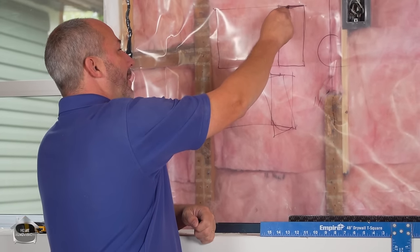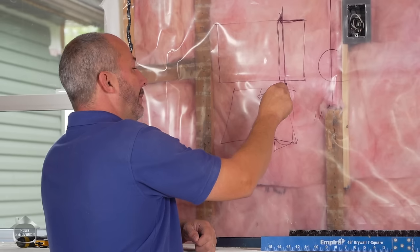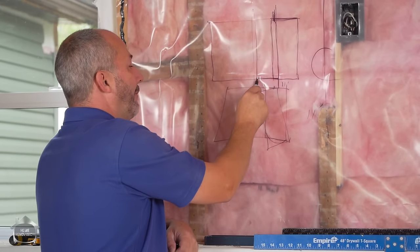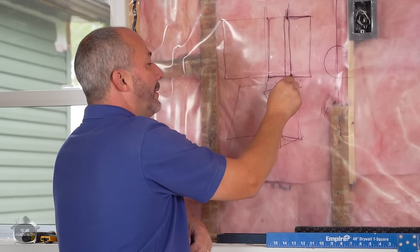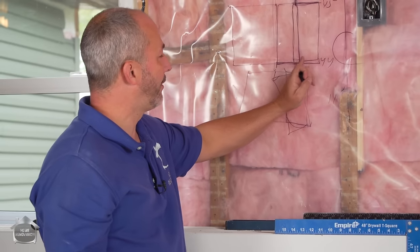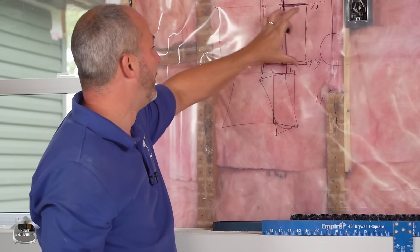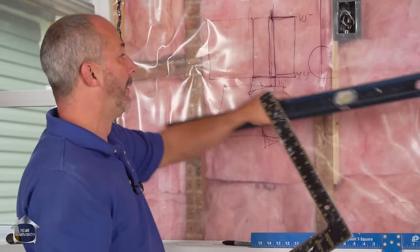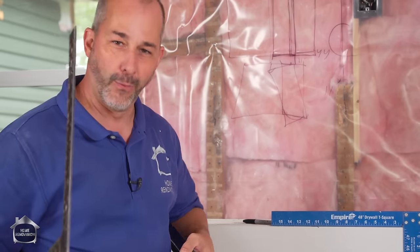What I want you to do is start by measuring over 45 or 46 inches, take that measurement, and write it on the wall — call it 11 feet. Move over 4 feet, take that measurement. Because you're using the short side of the wall, if it's still 11 feet here to here, you're installing it square. The distance might be 44 on one side and 45 on the other, but you can cut that because your sheet is 48 inches wide. Find the one corner that's the most square and work off of that one.